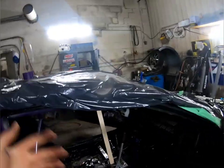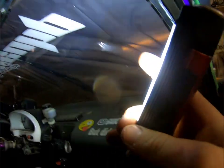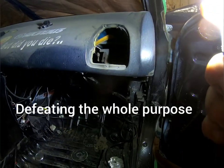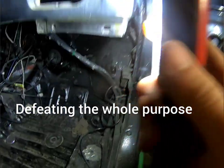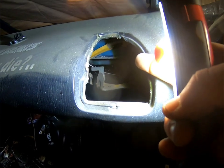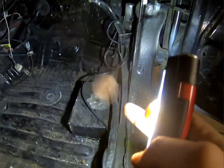The halo is in. Now the most important part is the A-pillar — they go from here down through the dash and then down to your floor. I've already got this boxed in from the last cage I made, with all 3/16 steel. I've got to come from here, go through this little part of my dash that used to be a vent, and then down. I need about a 45-degree angle here, so I'm going to start writing down measurements.